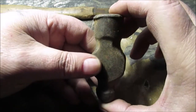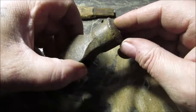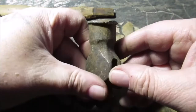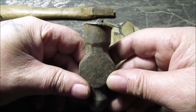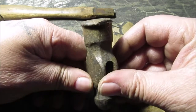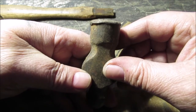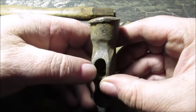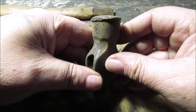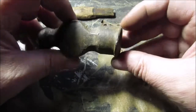If you really wanted to see that video, I tried to find it - where I redid that sledgehammer head. Trust me, it was worse than this. What does it take to do that? I pounded on stuff when I was a kid, worked for the neighbor, we had hammers where we junked stuff - it took a while to ruin a hammer. So we're warming it up, getting out the belt sander, taking it outside or setting it by the doorway. We'll have a fan behind us - you don't want to breathe that in. Even with a dust mask and goggles it still gets through the holes in the goggles.